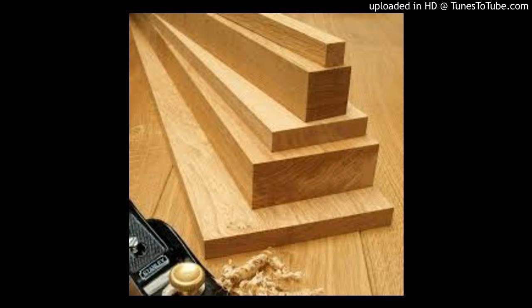It's quite possible when you're laying out a deck that those centres could vary right throughout it. But that's fine. It's all dimension. The builder can lay out to a dimension. And then what you've got to do is check any of your bigger gaps. And it's all fine except that one right in the centre. And we put another joist in, we've hit a post again, and again we take the easy way out and we just move the post.